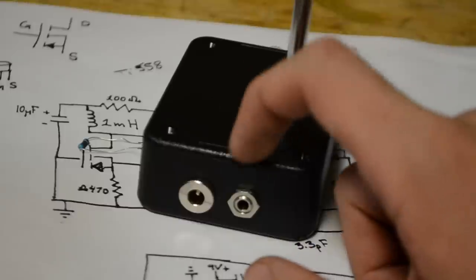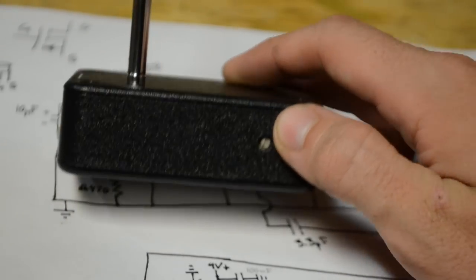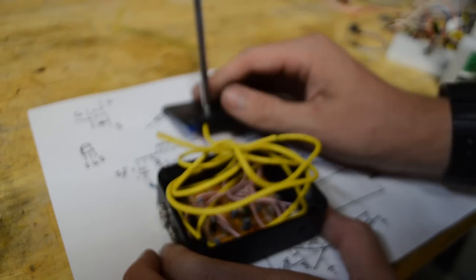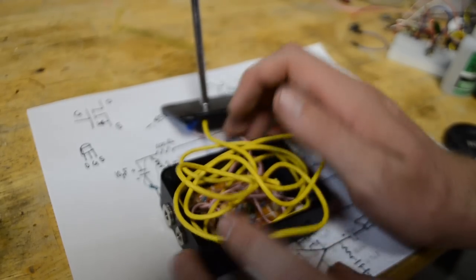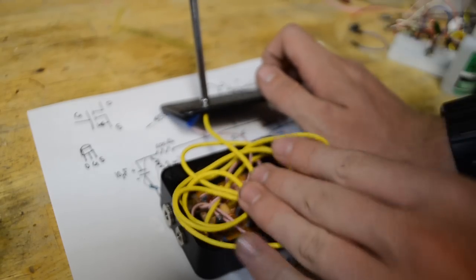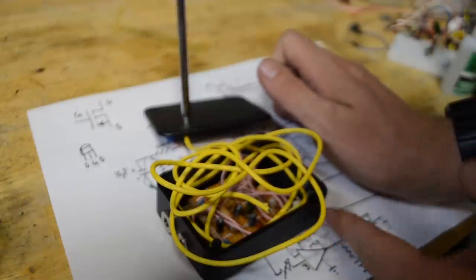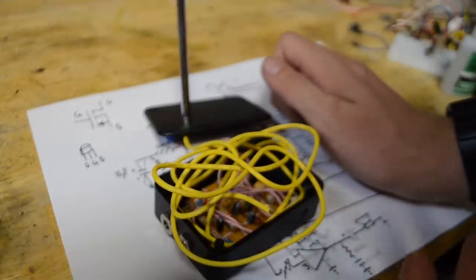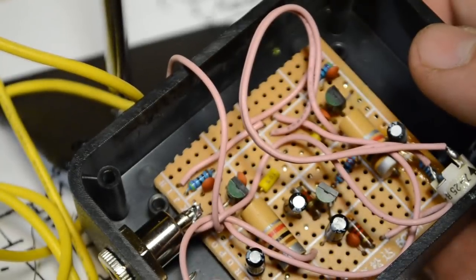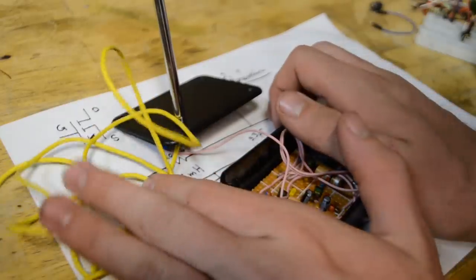Here's my sad attempt to play somewhere over the rainbow on the theremin. Let's go ahead and see what the circuit looks like when it's all soldered onto a PCB so it looks a little bit better. Here's my finished product — for the audio out I have a 3.5 millimeter jack into the side of the case, and for power in a regular DC power supply connector. For part of the tuning, I put a small hole in the side to access the variable capacitor. Inside, I have a whole lot of wire because the telescoping antenna I used is different from the original one, so I had to add extra wire to match its capacitance.